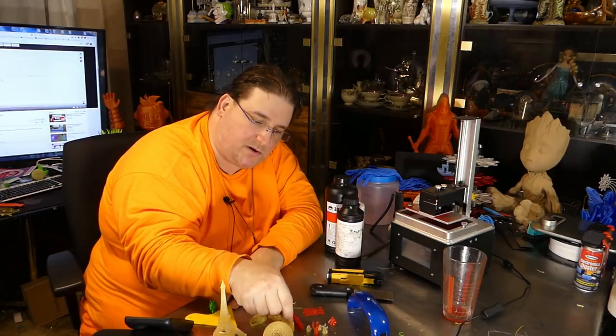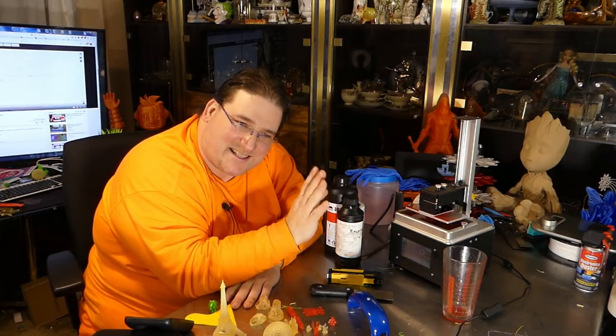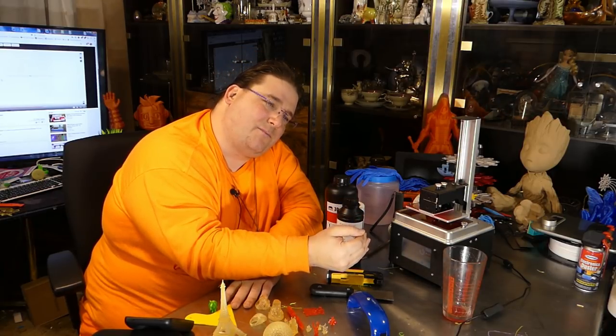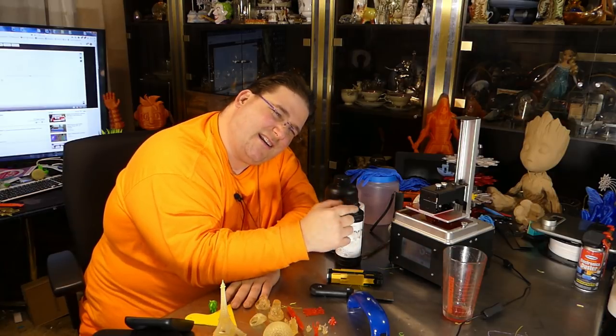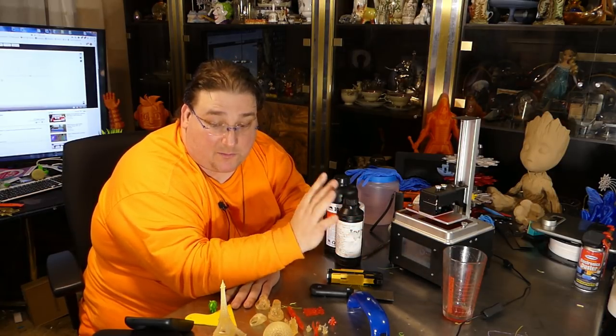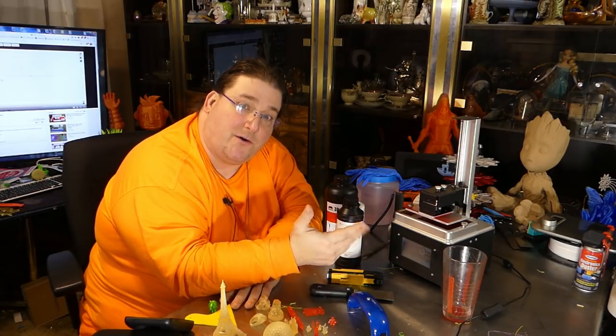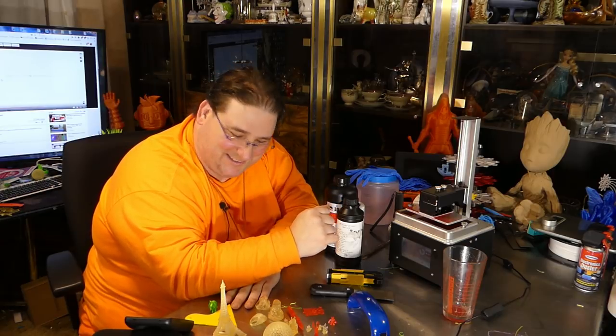I was able to print super complex objects like the Fantasy Castle, no problem. So it's not complexity. It just can't handle multiple STL files, because it's trying to save the STL files, but now there's more than one, and it doesn't know how to do that. It took me a while to figure out that's why I couldn't print multiple files. So this video is basically going to be teaching you how to avoid all the issues that I encountered.